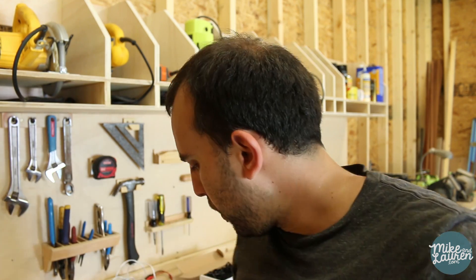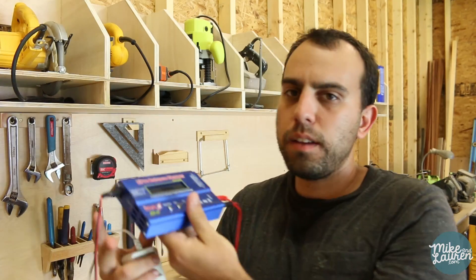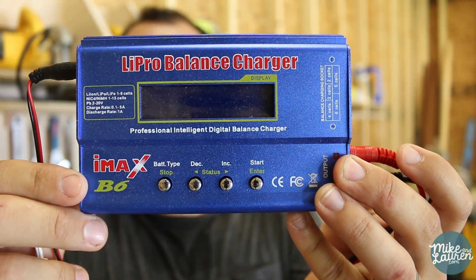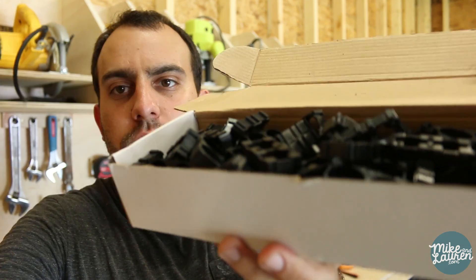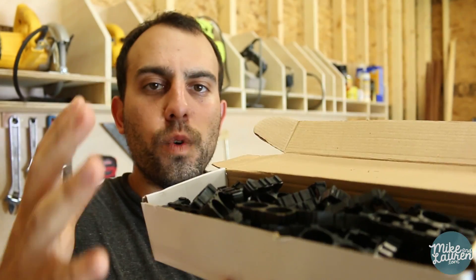Let's talk about some of the essentials if you want to make your own lithium-ion 18650 pack. First are the batteries themselves — we've gone over that. Second is a balance charger made for lithium-ion batteries. I use the IMAX B6, which I got off eBay for $19. It balance-charges the pack by charging each cell individually and keeping them all balanced. There's an issue with overcharging lithium-ion — if you go over 4.2 volts you can cause a fire or destroy the battery. I also waited three weeks for these little plastic connectors to come in from China, which attach all the 18650s together into one solid pack.